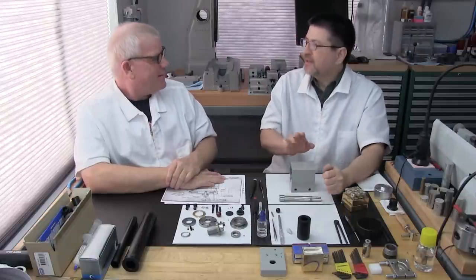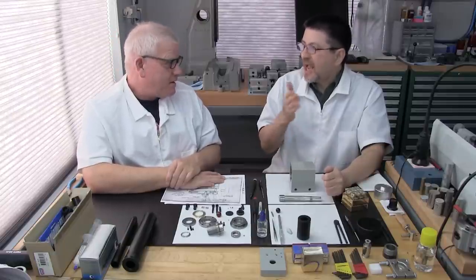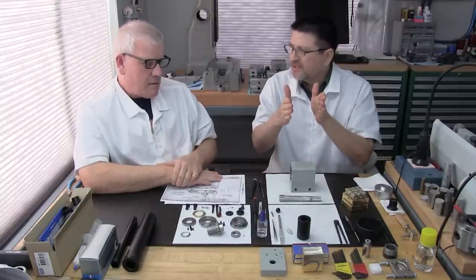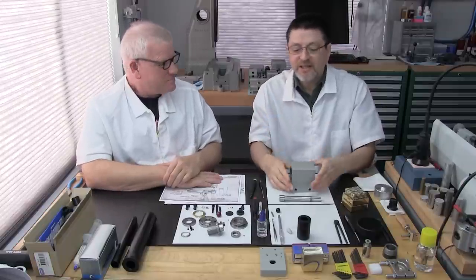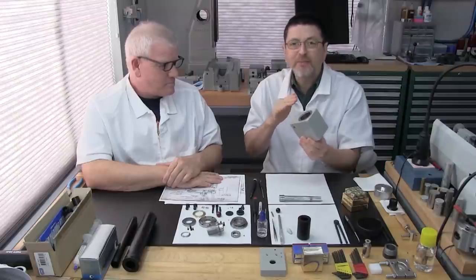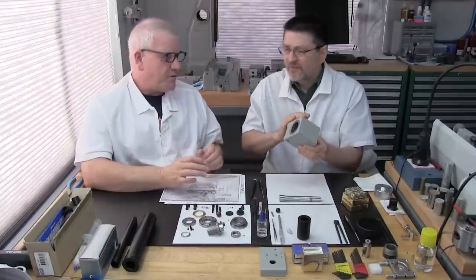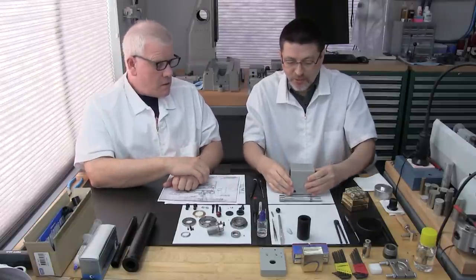But you know what's nice about the Levin Closed Style Headstocks? There's no preparation involved, like we had to do for the Levin Open Style Headstock. You mean like the snap ring and the bearing nut covers, the internal ones? Those are really unique to that spindle, just on the Open Style Headstocks. Fortunately, on the Closed Style Headstocks there is no preparation, but you want to ensure, like we mentioned in the prior section, just make sure it's all clean. Your threads are all good, and if you're going to paint it, you should have already done that by now. We don't want to be doing that after this sophisticated work we're about to perform here. Exactly. So we're good to go.